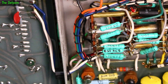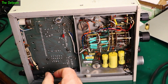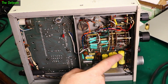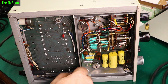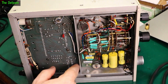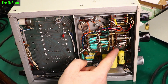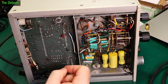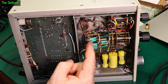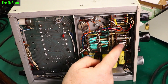Those are lovely 0.25% resistors. There are some transistors upside down in sockets, and the capacitors are actually in little holders rather than hanging off the PCB legs — real attention to detail. There are some carbon composite resistors which may or may not be problematic, and a spiral cap to look at. The carbon composites only have silver bands so they're 10% rated. If any resistors are going to be important it would be these ones in the ranging circuitry, as carbon composites aren't exactly wonderful.